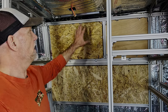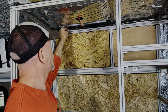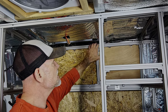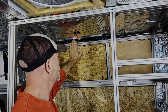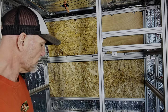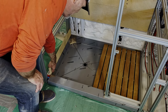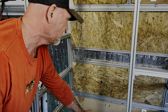The last thing I want to point out in terms of preparing for the build-out is that most of these vans come with a large cable loom from Mercedes from the factory that's controlling all sorts of electrical components. You want to take this into consideration and make sure that all this wiring is out of the way, and you've thought through how this wall will eventually come up to cover those wires, and how your ceiling will meet that wall in order to give you a watertight connection. We talked about the shower pan, the reasons why we have the front lip, and how we like to dado this wall so that it fits nice and flush with the pan, so we can run our tile directly into the shower pan and completely eliminate any chance for water leaks.